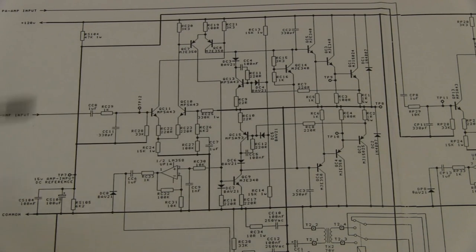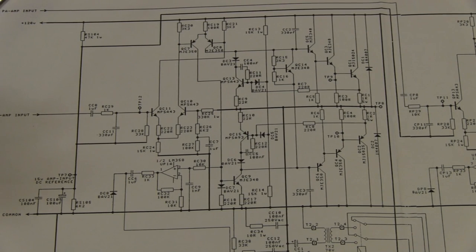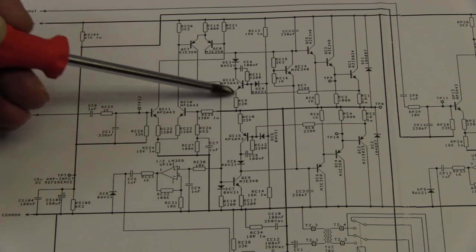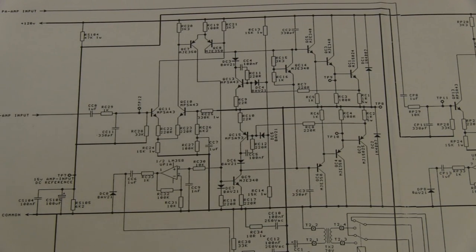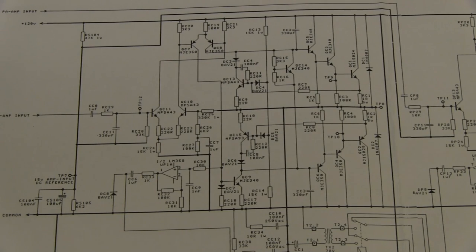How much distortion does something like that add if we're talking about a hi-fi? Would you do that on a rock and roll amp? Absolutely. Oh, well, it's essential, of course. The whole point is you design all of the circuitry around these VI limiters so that it simply does not take any action during normal operation. So if you've designed a power amplifier to run, say, 4-ohm speakers, you would typically not have those take action until the impedance drops below, say, 2.7 ohms. Got it.